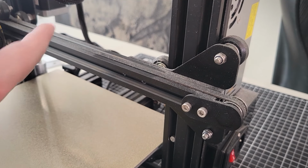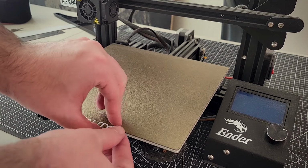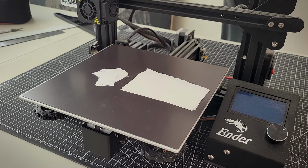It has auto level, oh my gosh, the auto leveling. Let me show you something. On my now dust-covered Ender 3, this is what I had to do before. Over time, the bottom adjustments on the plate were not enough, and I needed to shim part of the bed with thicker paper to try and get this all perfectly level.